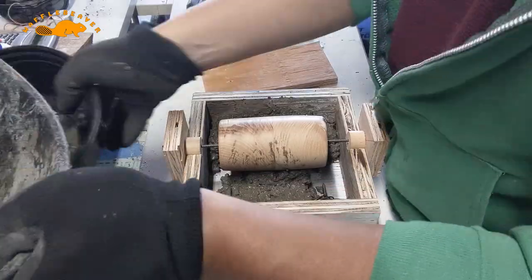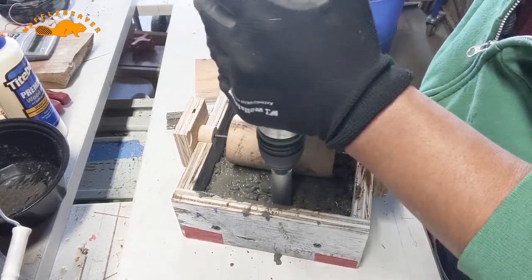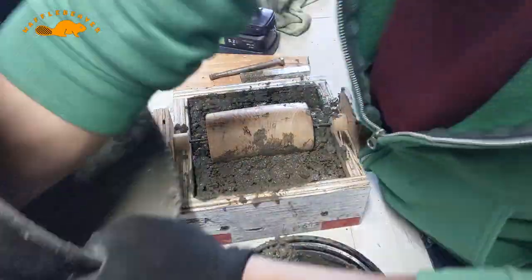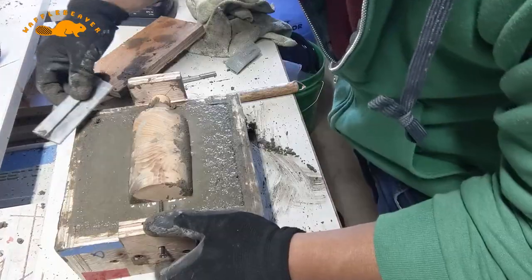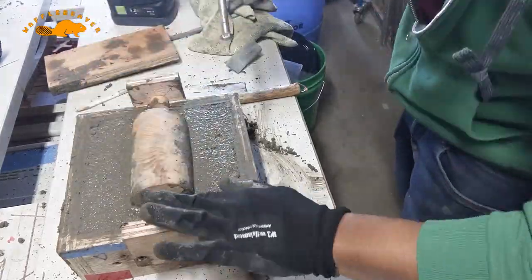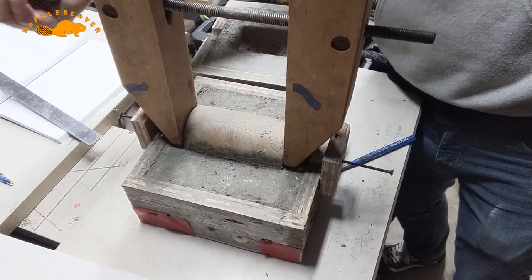I like an overcooked oatmeal consistency for my concrete mix. My drill is chucked with a piece of steel to vibrate the concrete into place. I also added some tie wire and wood screws in the side of the mold to help hold the concrete in place when it cracks — since there's two types of concrete: concrete that's cracked and concrete that's going to crack. I trowel the top of the concrete using anything flat-ish I have lying around, and to add some vibration to the mold I use a tiny steel mallet to hit all the sides. I repeat the same process for side B.